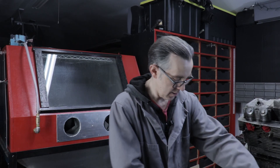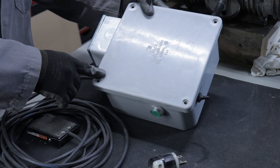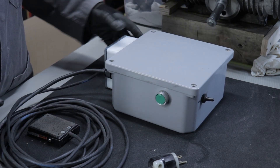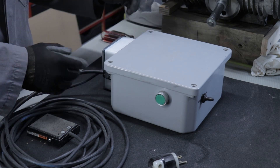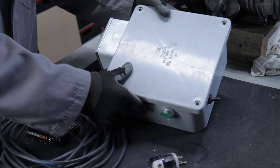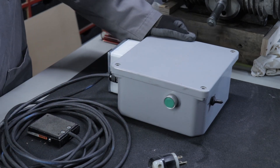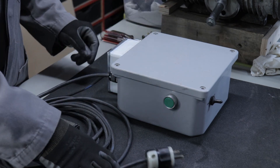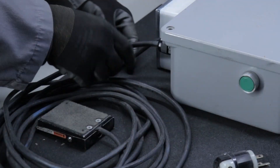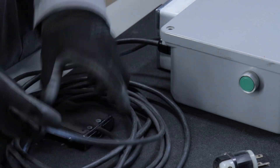Let's set this down and have a look inside. This is an 8-inch by 8-inch plastic junction box that's made for when you need to have electrical connections in wet locations. To the side of it I have attached a quad receptacle. This junction box was cracked so it wasn't really usable in wet locations anymore, so we've repurposed it for this control box. Really all these controls are is just a fancy extension cord. Here's the main power coming in, fed through these strain relief connectors on the side of the box. This smaller wire here runs to the foot pedal.